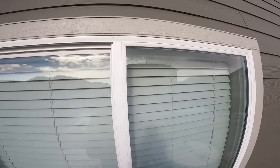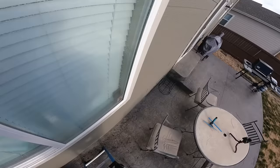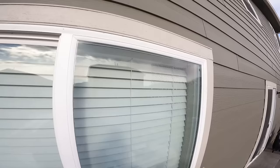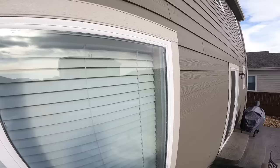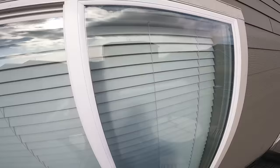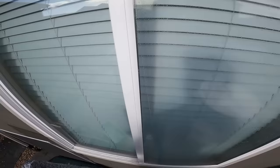If your rubber starts getting bad it won't look as good. If you're having to do three pulls, this is where you want to learn fanning. With a 12-inch on this window, you'd be pulling down three times — each time just wiping the edge, not the whole rubber. If you wipe the whole rubber it drags really bad, so keep solution on there, feathering at the top. Three pulls runs a lot of risk of leaving lines, especially when you're newer, so start learning to fan.